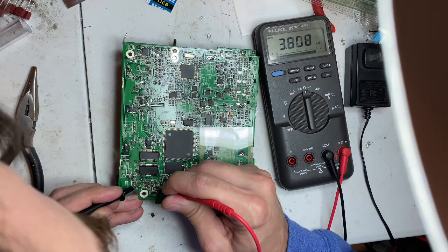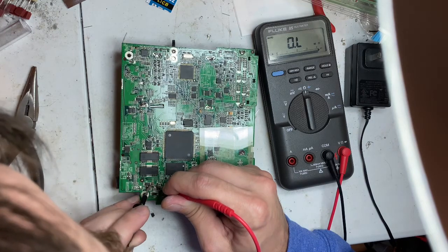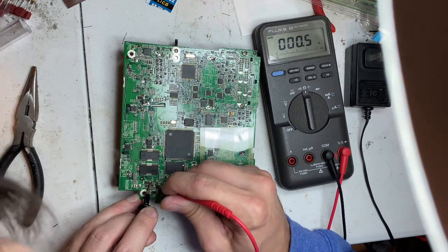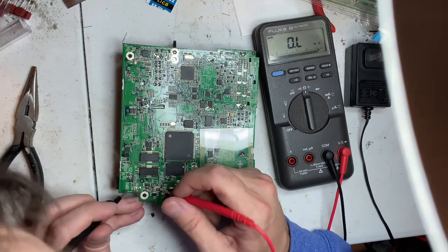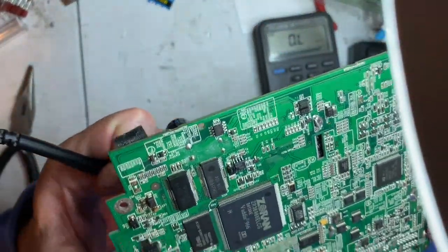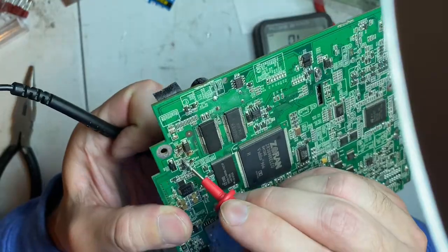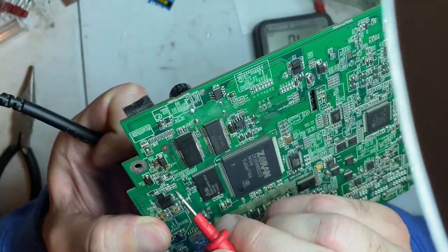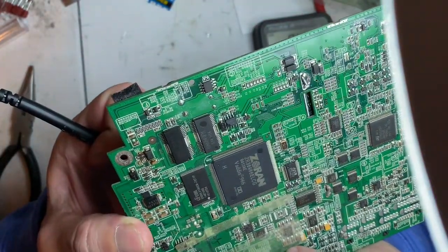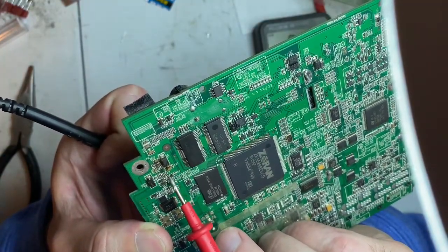If this is a buck boost circuit, then we'll be able to just replace this. Usually the MOSFET is what's involved with things. Alright, so there's the negative, and that'd be pin 4 over here. This is a negative pin. Pin 1 is where it shows the dot. There's this pin here that feeds this capacitor.